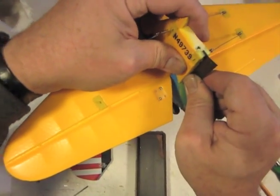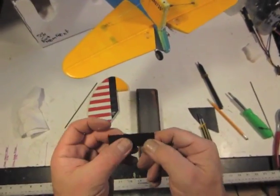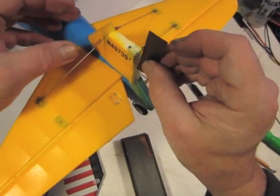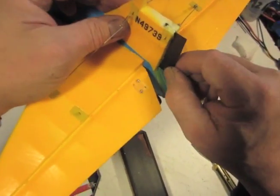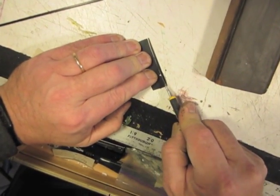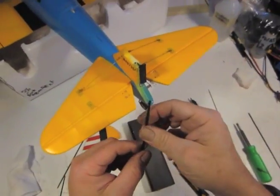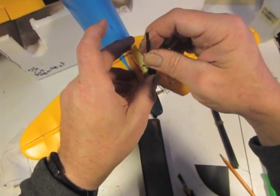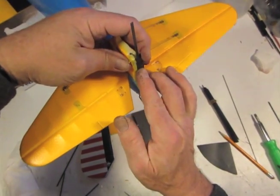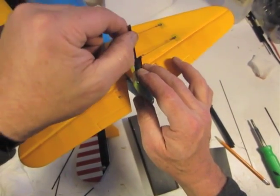Now let's check the piece to see if it fits the slit. It could be even a hair deeper, or this could be a hair shallower — we're going to cut this down just a hair because it wants to go a bit deeper, but something's in there — maybe our carbon fiber rod. So we want to take off just this much. Now it's going to fit right nice. We're going to use a 1×3 piece of carbon fiber as a spacer on the side here, and we fold the hinge at a 90-degree angle with that 1×3 in there so that the fold itself is this far away from the back of the foam.